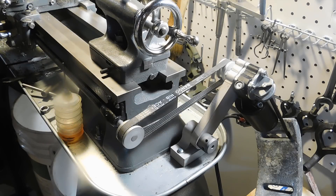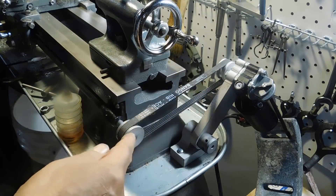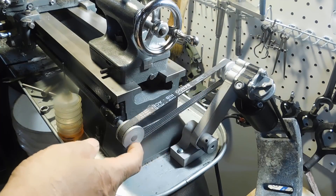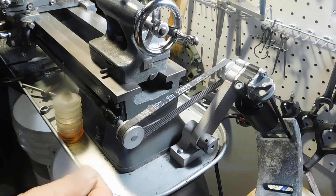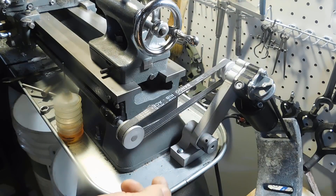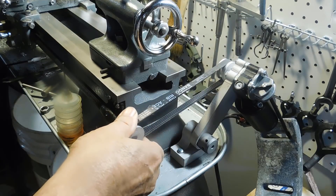I've made a couple of changes to the setup I showed you earlier. I put the pendant together and I've run it for a couple of hours, cutting all kinds of different metals. The most obvious change is I got rid of the two-inch pulley and went with a smaller one-inch pulley, so now we're working one-to-one. This is now Loctited in place. If the Loctite doesn't work, I have enough threads on there for a lock nut as well. I'm still using the belt for my surface grinder — I could have gone with a shorter belt, but I like using the same belt for both.